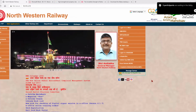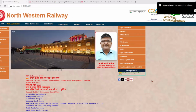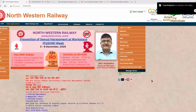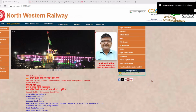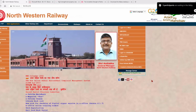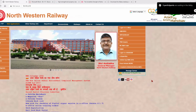Okay, so instead of rivet you want to use the high strength bolt. So ensuring other parameters which we want to achieve through rivets, temporarily we can make use, but don't treat it as HSFG bolt. And it will behave just like your rivet. If shank size is same, it should carry same shear force. Designing should be checked with respect to that.